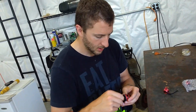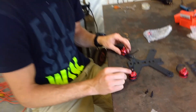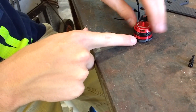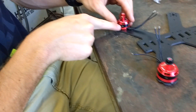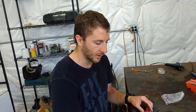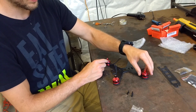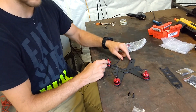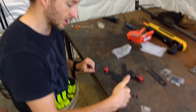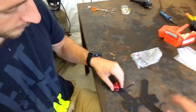When you're laying this out you want to make sure you get two different kinds of motors. The ones we ordered you can tell by the black screw cap and also the direction marked on the motor - they turn different directions, one counterclockwise and one clockwise. You want the clockwise one on the bottom right, counterclockwise on the bottom left, and the opposite up top. You'll have to program these with the speed controller and number them motor one, two, three, four.